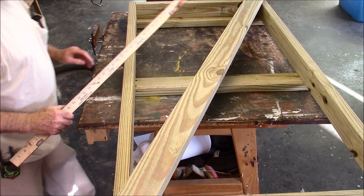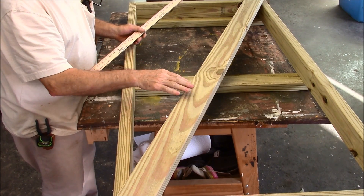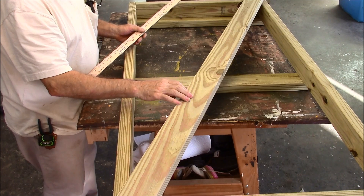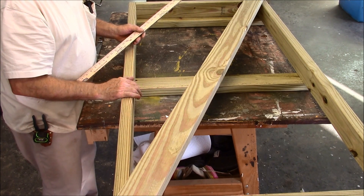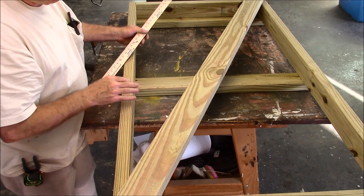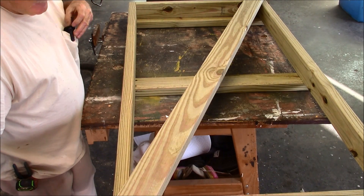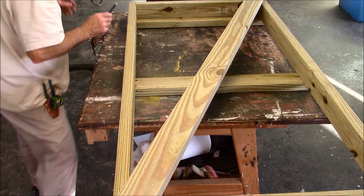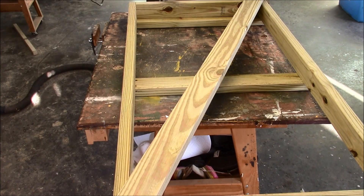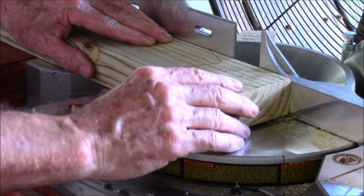In this kind of gate construction, the diagonal brace has to be 45 degrees or less — this one happens to be about 25 degrees — and it has to fit down inside precisely. So what I'm going to do now is basically take a pencil and reach up under here and trace these angles. I'm going to cut it fat and then walk it into the line.